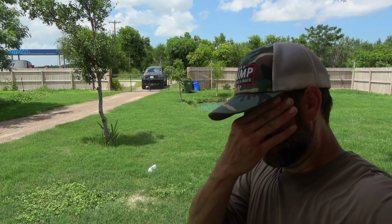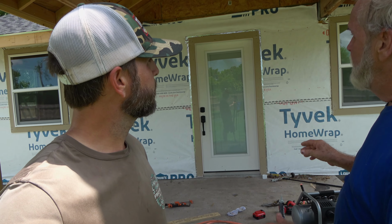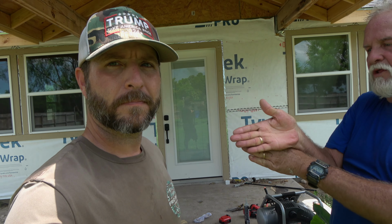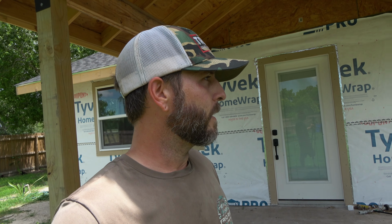And we're going to put a little starter strip all the way down across the bottom. It's only going to be about 2 inches wide. And what that does is when you overlap the other one, it automatically holds it out. So we'll go back up, finish up a little bit of paper here, and then like I said, we'll be ready to start putting up the siding most likely on the next video.